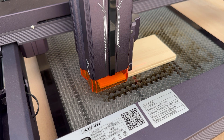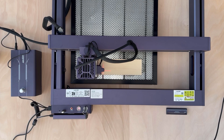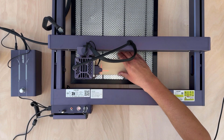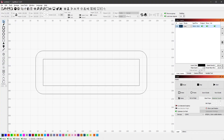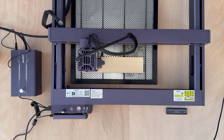To position the wood correctly, click the frame button and the laser head will move around the area where it will cut. I've slightly repositioned the wood to make sure the design will end up in the correct position. In the cut/layer settings, I've increased the number of passes to 3, set power to 100%, and decreased speed to only 10 millimeters per second, then clicked the start button.